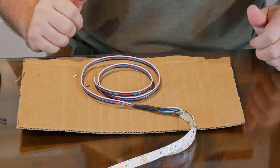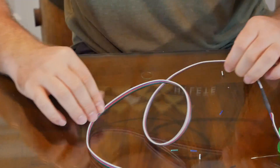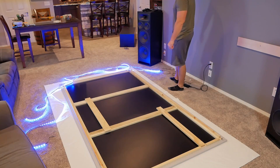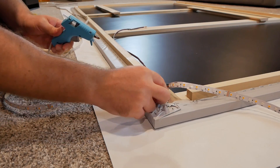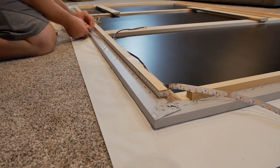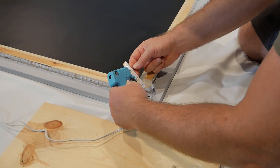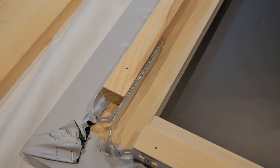After soldering, it's always a good idea to test the lighting to make sure all the colors still work. I hid the wires inside the frame and started routing the LEDs around the mounting strips, peeling back the paper to expose the sticky backing. A dab of hot glue was applied every six to eight inches to ensure the strips would not fall off down the road. I worked my way around to the opposite corner where the two strips would meet. To prevent any gaps in light, I looped each strip a bit and tucked the excess inside the frame. I overlapped the strips and glued them together to reduce any excess light behind the screen.